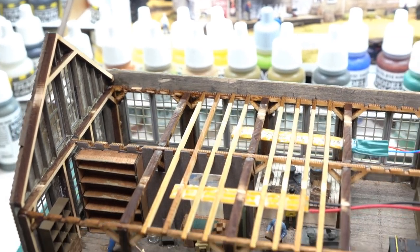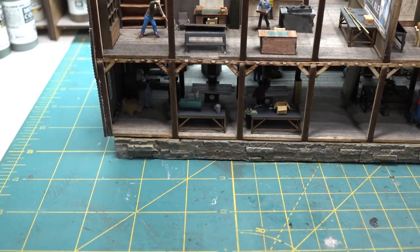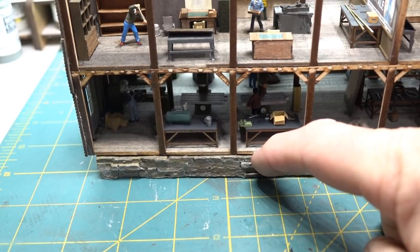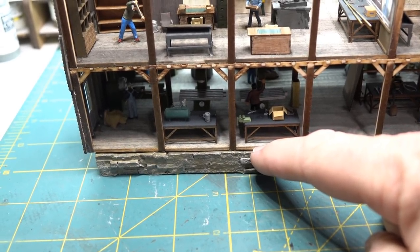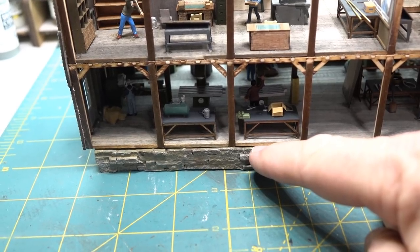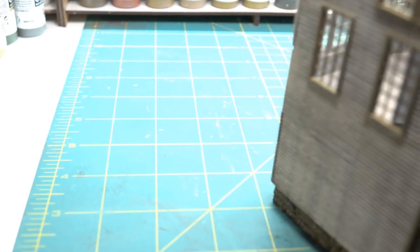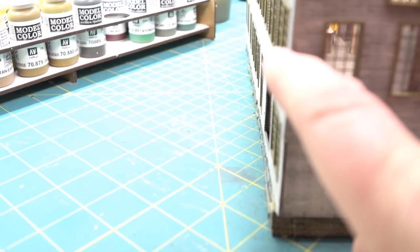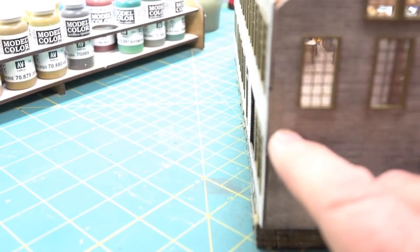Both sides are like that, but again, maybe it's my inexperience, the way this thing sits on the foundation, I mean, the floor is the width of the floor, and it's centered, and the concrete base overhangs the floor, which means when the sidewalls come on, they're going to sit on that. If they extended down, then I could have brought them down a little bit. But, sort of, kind of, but not really, because the end walls have the typical notch that lines up with the wall. So this wall is going to sit where this wall is, and vice versa. And I can't bring this wall down any lower and then try to raise this wall up.